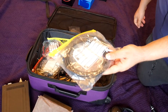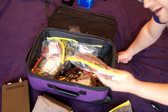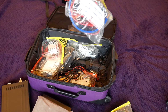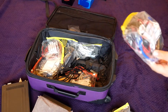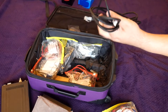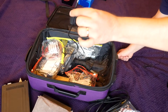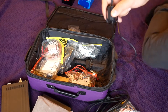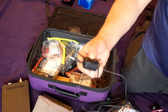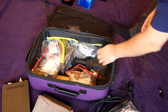A patch cable — if the antenna wire is not long enough, this helps me extend it. Some power cables to connect the radio and some of the other batteries. Also a very short Ethernet cable in case something happens to the cable between the radio and the control head. This is the ICOM cable for controlling the radio — it's a very nice cable; even at cold temperatures it's not stiff, so they did a great job with that. Here's the audio cable for the headset. I found that the headset is really not RF protected, so I did add a choke on the cable, which helps tremendously. But still on 40 meters and 80 meters I have problems. I should replace that headset someday, but it hasn't been a priority.